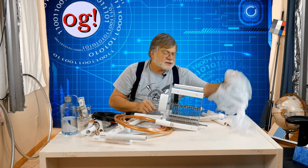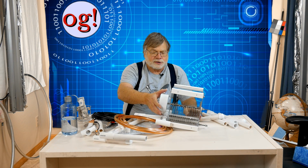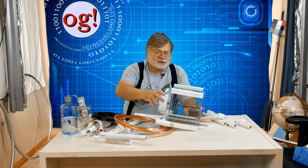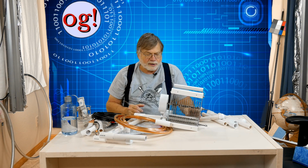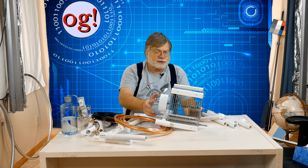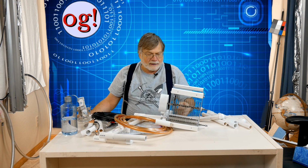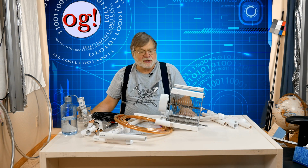The way it says to tune the antenna when we put it together is you tune the capacitor for max noise, and then you use a broadband tuner to bring it into tune. So there it is. We'll put it together. This really impresses me here. This took a lot of work to do. When we put it together, we'll take a closer look at all the parts and see how it works.